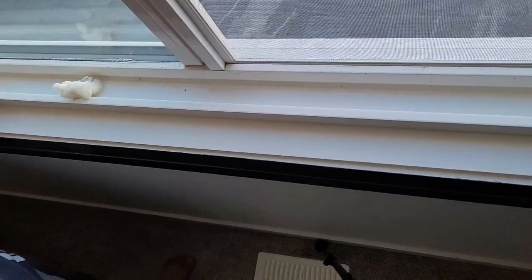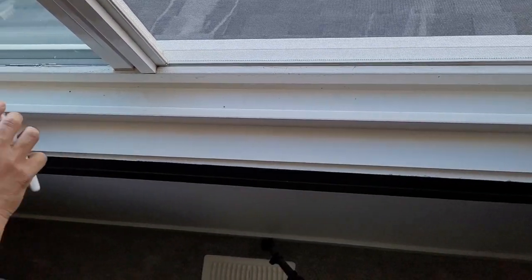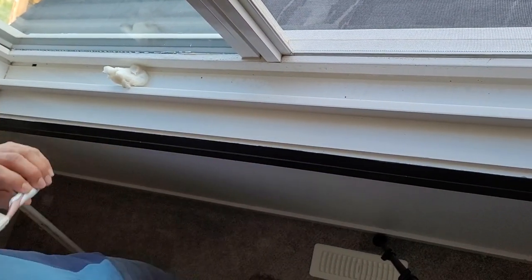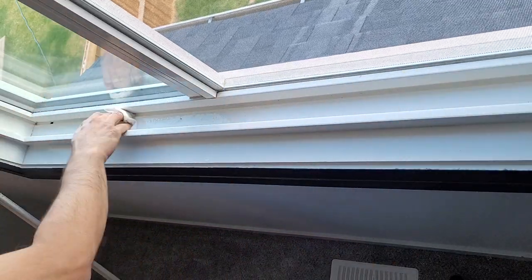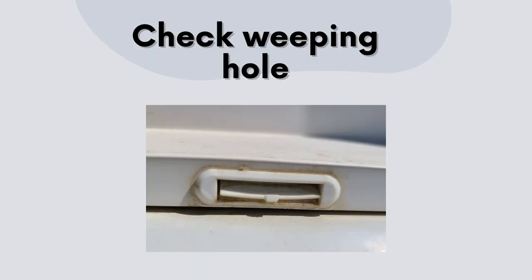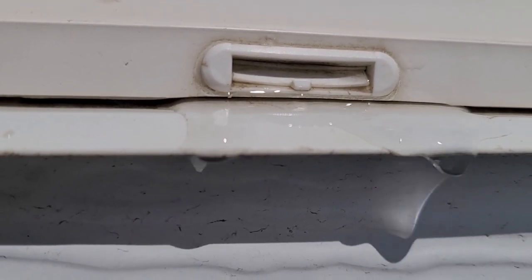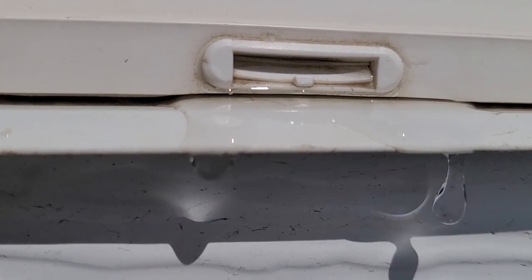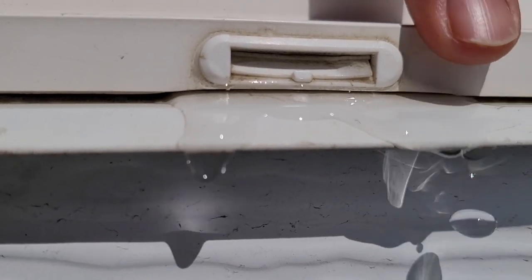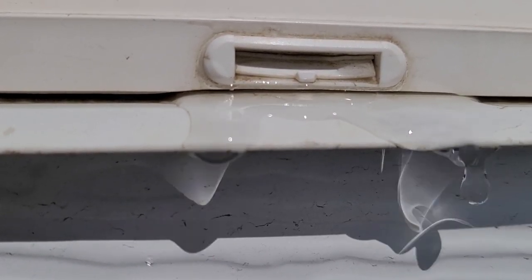This is the right time to clean those corners. Once everything is clean, use a paper towel to do a final wipe of the drain. You will also need to inspect your window weeping holes — pour some water into the window drain and if it drains smoothly, it's good. Otherwise, remove the weeping hole caps and clean them with a small pin or brush.